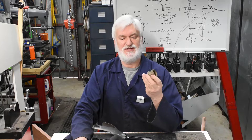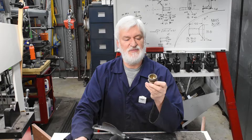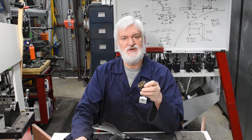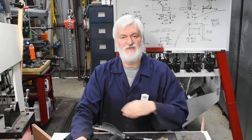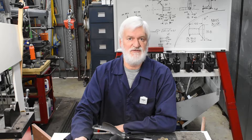He's supplied me with a scrap of brass that should supply the material we need, and I've given a bit of thought to how to do it. I'm going to try in the first instance just doing it as a straight machining operation with very light cuts, and hopefully I'll get away with machining the really thin wall. That thin section is only 5 millimetres long, so it's not a huge length. But if that doesn't work, I think I'll have to make up an arbor and mount it so we get support from the inside. But let's try the easy way first.